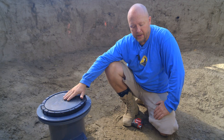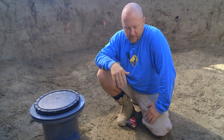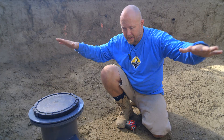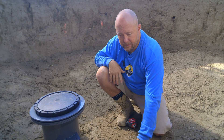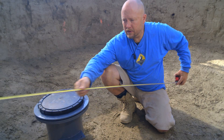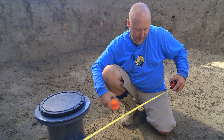It's time for us to start working on the bottom drain. We're going to show you the placement of where we need to put this in the very floor of the pond. My first bit of advice is I want to get it right in the center. We dug the pond in a perfect circle, like an egg shape, and everything is tailored down to the center. I've measured it out - we're about 14 feet across, so I'm going to mark half of that.